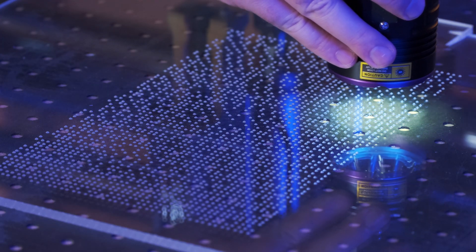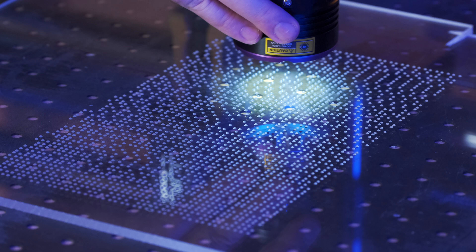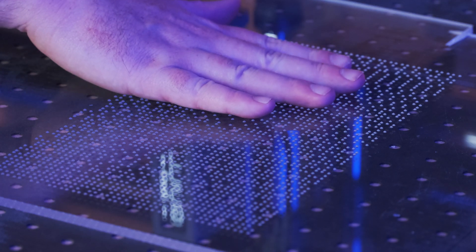If you mess up, wipe away the resin and print again. Once the printing is done, the resin can be cured using a UV flashlight, creating a highly durable product that is going to stand up to people messing around with it — touching it, that kind of stuff.